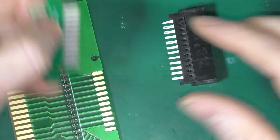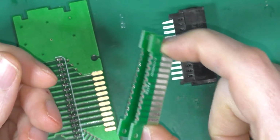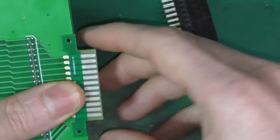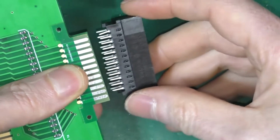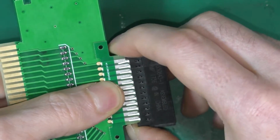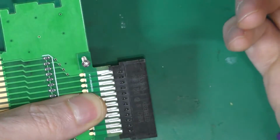So I made some patches. I call them patches, which are two PCBs 1.6 millimeter thick with castellated vias, and you install them like that. As you can see, you have holes here, which are going to be for holding the PCB. I'm off by about half a millimeter, but it's working fine. So you will need 10 millimeter high standoffs and M2 screws to hold them,